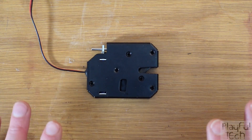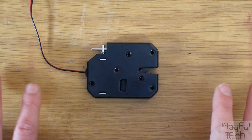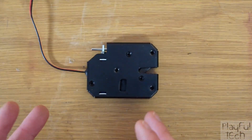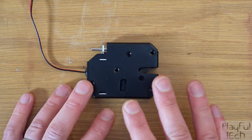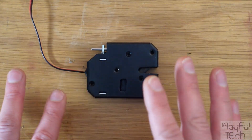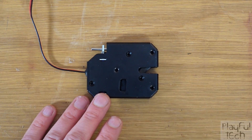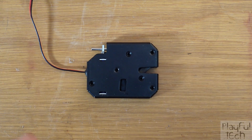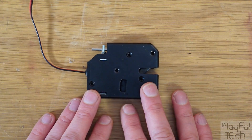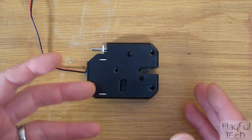Now let's take a look at a completely different style of lock. This is a cabinet style mag lock, and it works in the opposite way from the previous locks. Its default state is to remain secured and you have to supply power in order to unlock it. So this is described as being fail-secure, in the sense that if there's a power cut for any reason, the lock will remain locked. That means it's absolutely critical that you never use these locks to secure a physical space that a person could get trapped in — only use them for securing drawers or small compartments. But one of the great things about them is that because they don't require continuous power to remain locked, they're great for use in portable battery-powered props, since power is only needed briefly in order to unlock it.